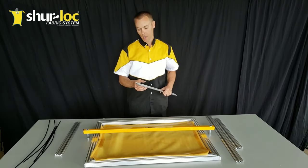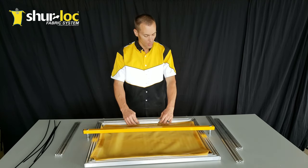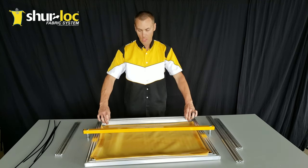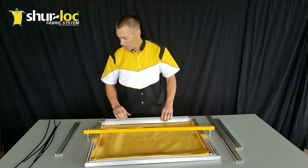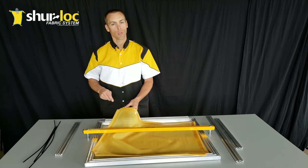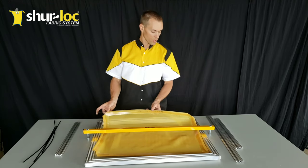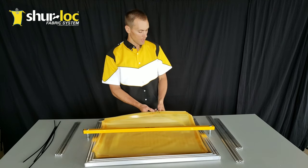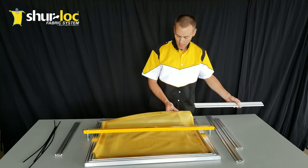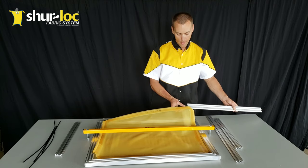Always start with the long side first. We've got a series of three separate hooks on the bottom that engage right onto the frame. Hook one is in the front, hook two is in the middle, hook three is when the tension bar is flush and fully stretched out. Take one of your long rods - remember these rods come with each frame but are completely reusable. Anytime a fabric fails over time, just slide those out, keep them clean, and reuse them for your next set of panels.